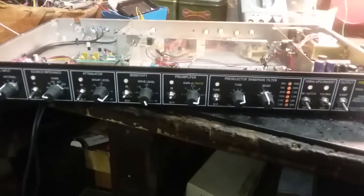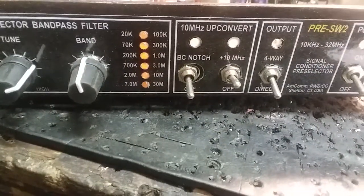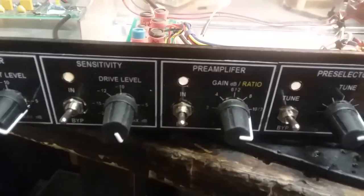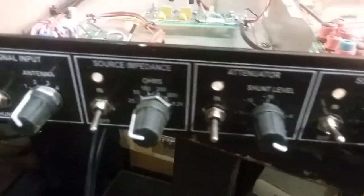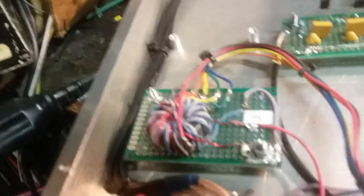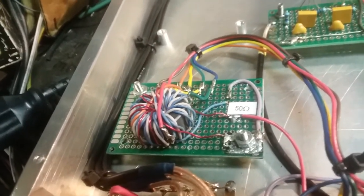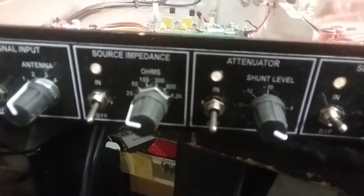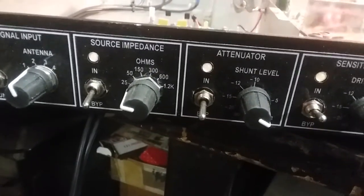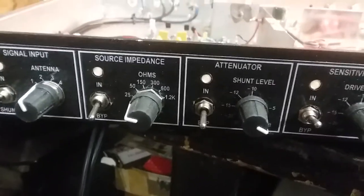If you're familiar with this thing from YouTube, it's an all-band preselector and it's got a lot of nice features — preamp, impedance matching, overload control, and antenna selection. There is a typical transformer here: it's a type 43 ferrite toroid, wound to give essentially these impedance matches for a 50 ohm receiver input — which they never actually are, by the way.